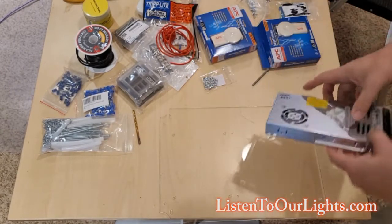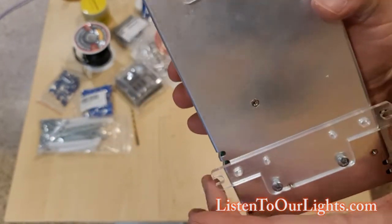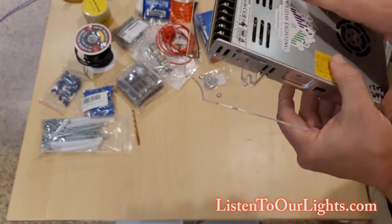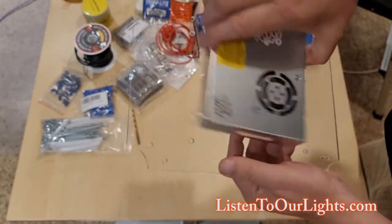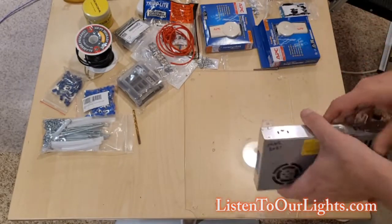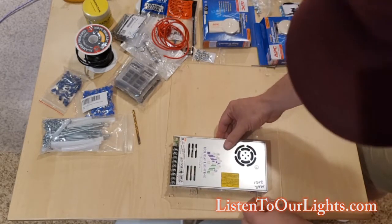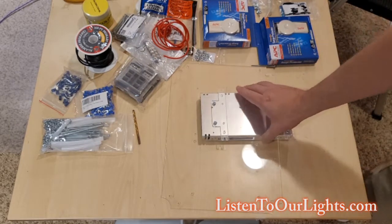So the first thing I'm mounting up is the power supply. I already put the shoes on - that way you can mount it from the edges, which is very convenient. I've got the holes set up, but it's very close on the sides. I want to give myself more room on the sides. Like this - see, this is right up against the wall. This way I have a little more room, but it would be handy if I could get myself even more.